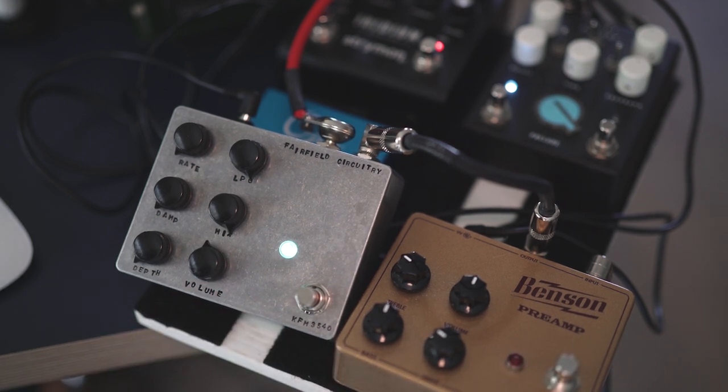So obviously you can tame it with volume. And like I said, it's adjustable. There's a jumper internally that allows you to disable that if you don't want it. But I think it sounds really good, and it interacts really well with that low pass gate, which is going to pull some of your volume, which helps keep it present in the mix. But when you low pass that JFET boost, you'll also get some really cool darker, grittier, hairier textures. But we're getting ahead of ourselves.